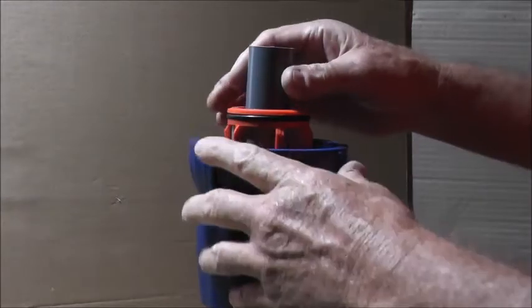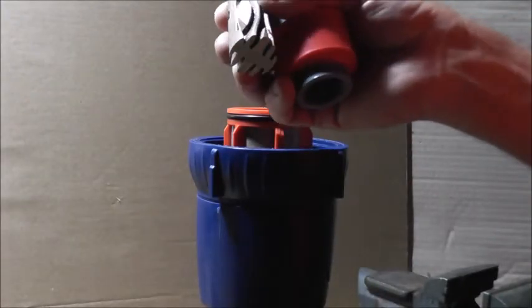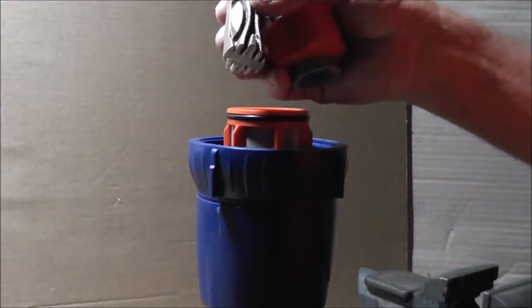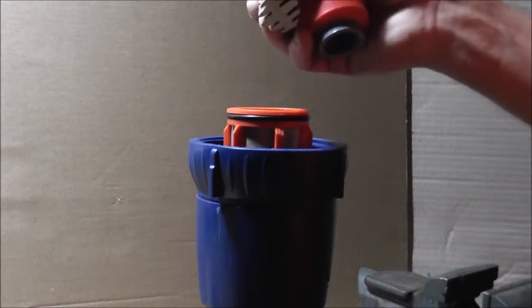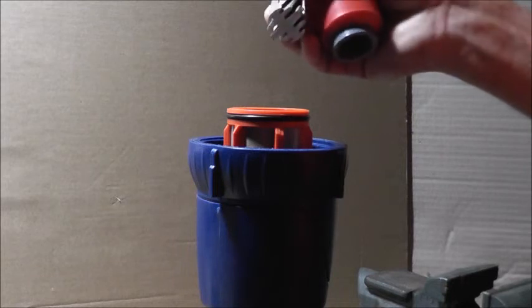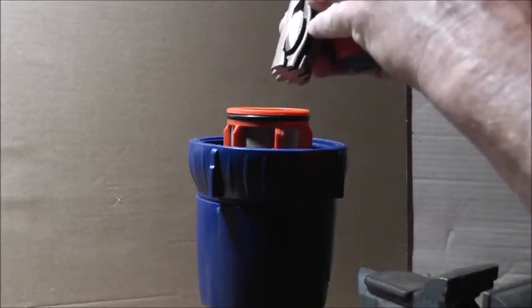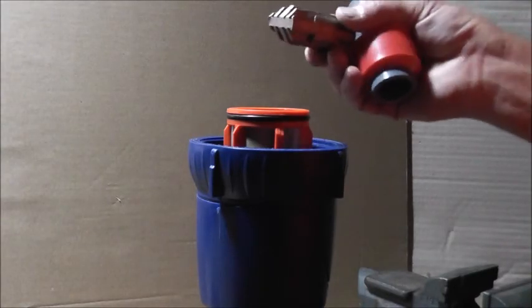After that's done and you're sure there's no water pressure on anything, take the bottom off and the entire assembly will be intact. This is the bullet core — this is the catalytic core that is very important to keep clean. To clean it, just use a wire brass brush. Whenever you pull everything apart, brush it up as good as you can under water. Soak it in vinegar for an hour or so — that'll make it look nice. It doesn't need to be real shiny, don't worry about that. But if it gets green or crusty, that's the kind of stuff you want to take care of. Try to get your brush in between these crevices too, because as water flows through this core, turbulence is created and that's where the ions are actually added to your water. So the cleaner you can keep this, the better quality water you're going to get.